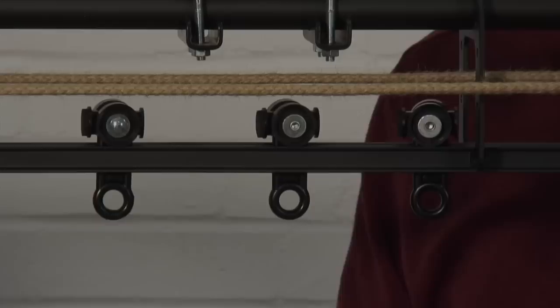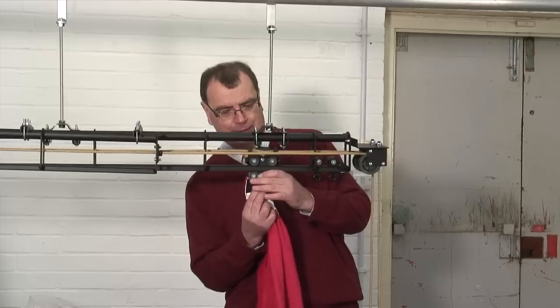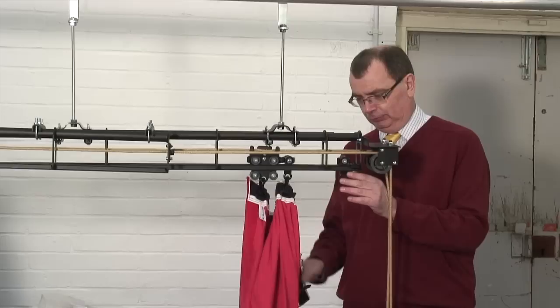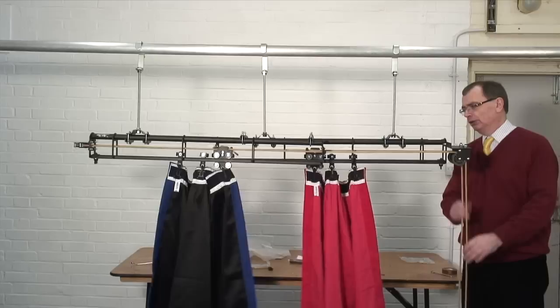The last bit is to put our drapes on — we'll assume you're standing at the back of the stage and put the drapes on back to front. And that's all ready to go. So there you are — that's all you need to know on how to put together an overlap track with a hand-line operation. If you get stuck, you'll find there are some PDFs with diagrams on the hallstage.com website, or you can get in touch with us and see if we can help you. We'll see you next time.